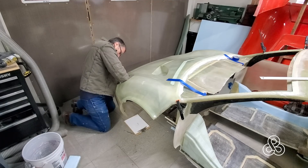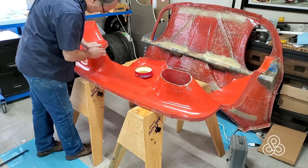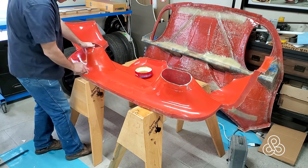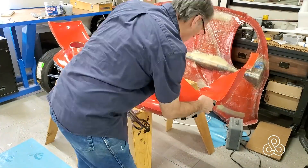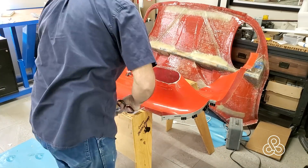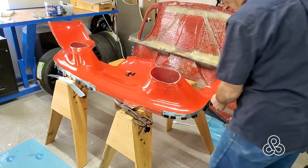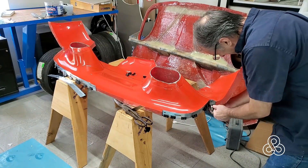The real thing we need to jump to is the tail end — go to the back bumper, that's the topic of today. So prepping that mold, we're going to wax it, put some releasing agent on it, and then get our flashings. We always have to do our flashings to create that little turn back, to create our part with some structure to it for all the joints that can occur on this thing.